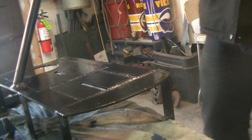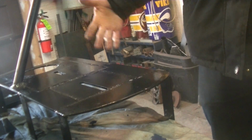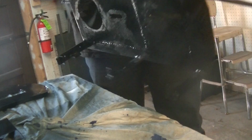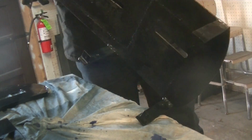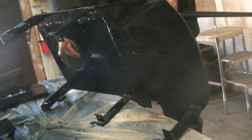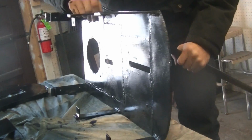So the next big piece is basically I needed to have a reduction system. I'm using just a regular motor, and I need to have some sort of reduction. So I just used a bunch of pulleys that I made in the wood lathe, and I'll show you later. This is the bottom part, and it's a bunch of steel plates that I had lying around the shop that I just welded together to make one big plate. This hole is where the motor goes. We got some slots milled in there, you can see, to allow the pulleys to adjust back and forth.